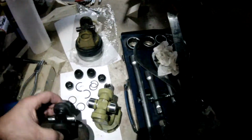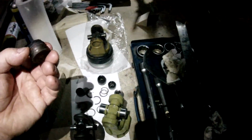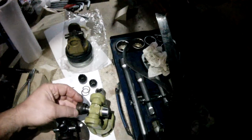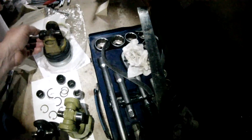As a consequence, this bearing uses a different outside diameter, and it has this inside clip. So I have to use a typical bearing from the automotive style, which is this one, to get the diameter and to get the clip. But the length of it is such that if I mount that onto the agricultural shaft, this one with the taper, it won't go in properly and you end up with this dimension being too great. However, if I mount that same bearing onto this one, also agricultural, it in fact goes on correctly and gives me the correct diameter across.